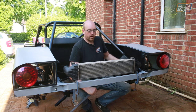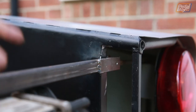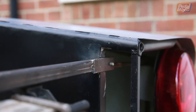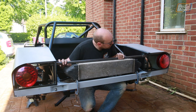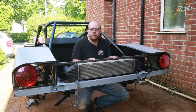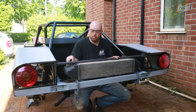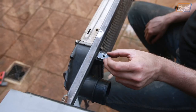Across the top of that we've welded in a couple of little brackets, and this cross piece goes in on these two little studs — probably like that — and this holds the intercooler in place. We're going to add a couple of little tabs which will just bolt onto the front side like that.